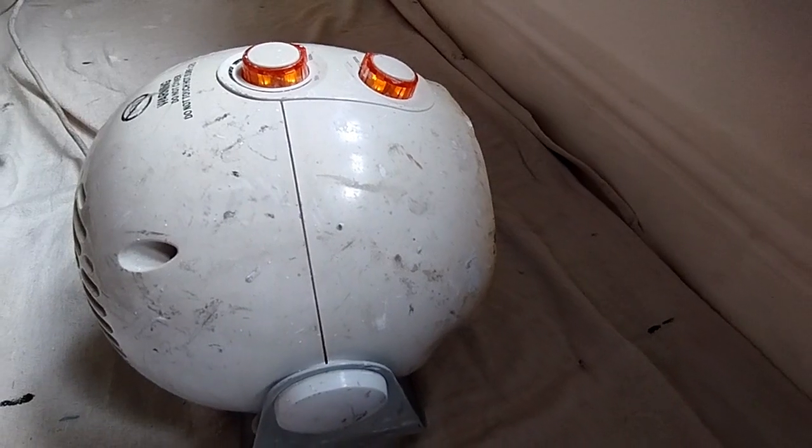Another top tip: make sure you spread your paint out really well, cutting in everything in the corners. Because if you don't, that can take ages to dry. So as soon as you've put a coat on some of the coldest parts, what you want to do is put your heater on it straight away.